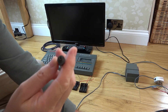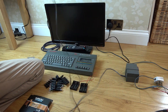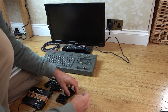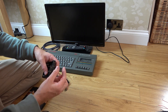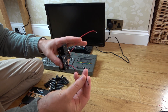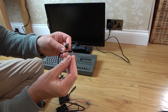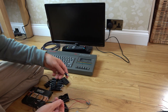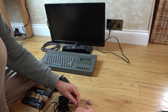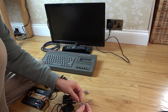The plug looks very similar to this one here, which has exposed wires at the end. The batteries are now wired in series — positive and negative connected together. On this plug the middle pin is red and the outer pin is black, so we have to wire it the wrong way around — black to red and red to black — because we need the center pin to be negative. We'll check it before plugging in.